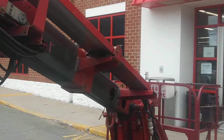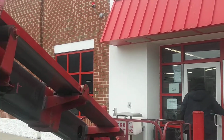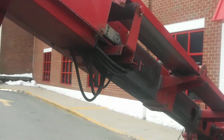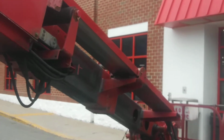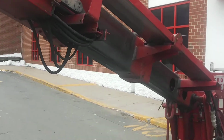That's way too much. I remember one time we had to do a neon sign, right? So this guy tried to jump off the other transformer. He burned up the whole transformer because you gotta isolate the transformer for wattage. If you try to piggyback off the other one, you burn up the whole thing.